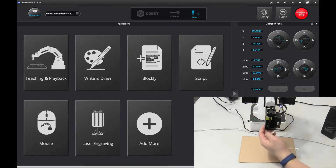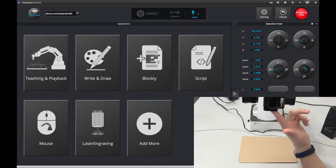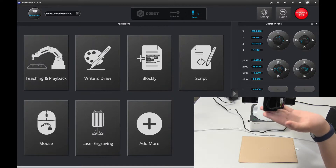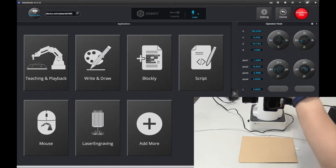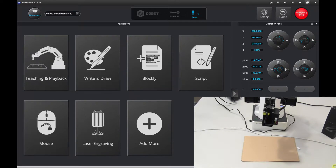That's an example of pretty good adjustment. If it doesn't come packaged like that by default, there's a knob on the head of the laser where you can adjust the sensitivity. That can be used to focus the light on a smaller area, which will put more energy, and that will probably let it burn.